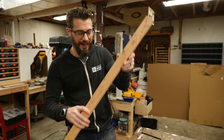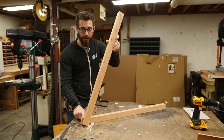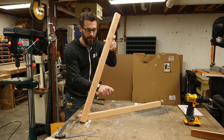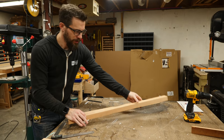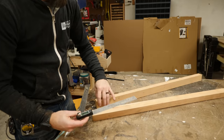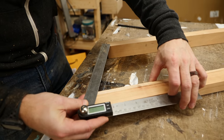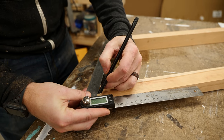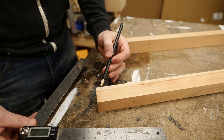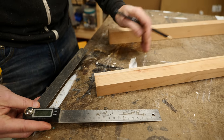I've got these pretty much cleaned up. The idea is for there to be a tall piece sitting at an angle that's connected to a bottom cross piece, and then there'll be another one coming up for support. I want this piece to sit at about 70 degrees. So I took my protractor, set it to 70 degrees, lined up the outside edge right on the corner and drew a little line. If you take 70 away from 90 you end up with a 20 degree angle, so we're going to set the miter saw to 20 degrees and cut off this chunk on both ends.